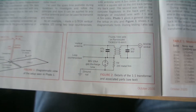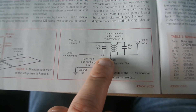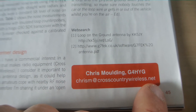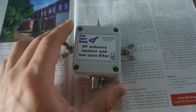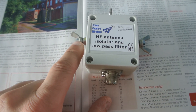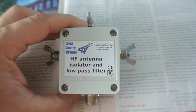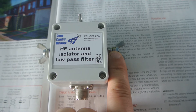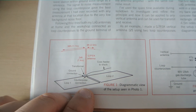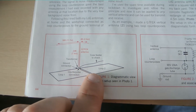You need a special transformer/isolator for this — he gives you the diagram and he does sell them on the website as well. The website is crosscountrywireless.net. I bought one of the transformers. You've got your coax connector, that's for the vertical element on the antenna; on top is the connection to the earth rod for lightning protection and static discharge; and this connection here connects to your loops on the ground. In the diagram he's used 20 meter radius loops — that's what they recommend — so he put two loops in, a total of 40 meters of wire.